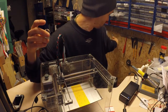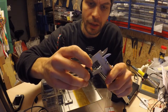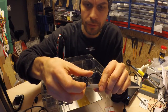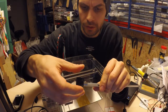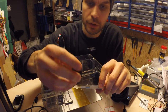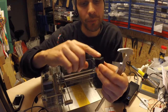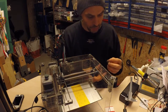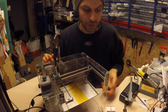I have my caliper here — let's just see the measurements. It's supposed to be 20 by 20 millimeters. So this is... 20 — perfect. And 20 — a little bit more — 20.2. And the height — spot on 20. So except for the rough edges, I am really pleased with this one. It sure is worth the 100 quid I paid for this. So let's do something else.